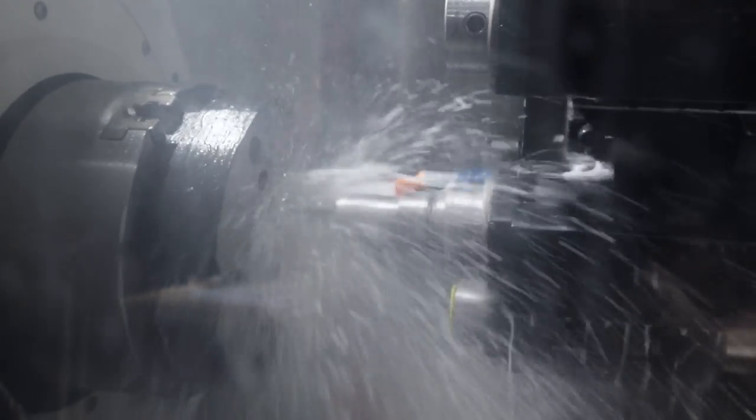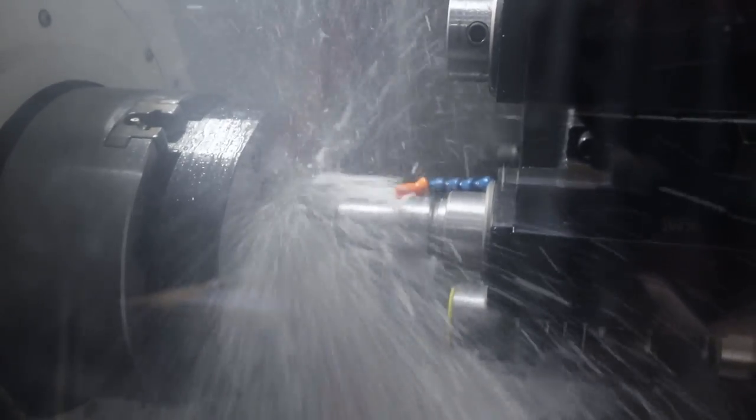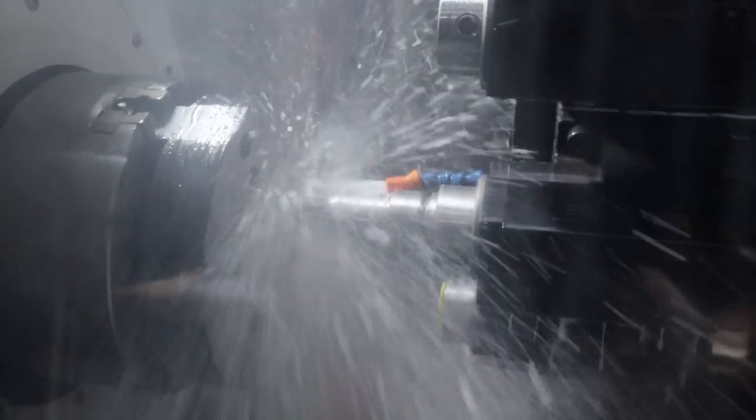The specific application right now — the tool is kind of hanging out long. What are you running? About 20 inches a minute, 170 SFM. The chip load is a little lower, around 0.0025. The surface footage is decent but the chip load is a little low, so you hear a little chatter — but we have to realize we're doing live tooling, with a spindle in the turret, so you don't want to put too much pressure on it. And 20 inches a minute is no joke in Inconel.